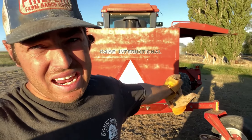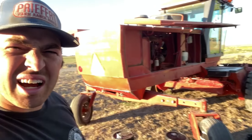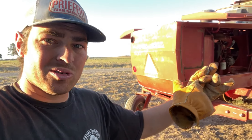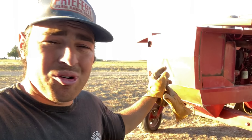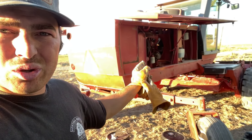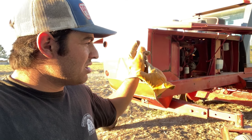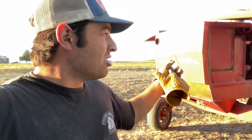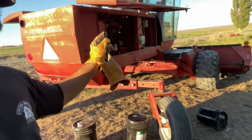It's a few days later, back on the 8840 Case - a self-propelled wind rower, I believe is what it's called in the manual. I just finished putting 15 more gallons of hydraulic fluid in it and we are now full. That took 25 total gallons. I'm gonna check the coolant because I know it was low at one point, and then make sure it starts. Once it starts, probably figure out about that cable or the linkage to completely disconnect the head - that issue we were having.